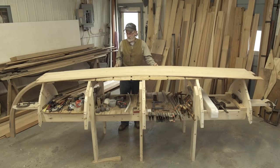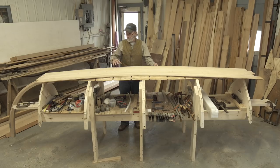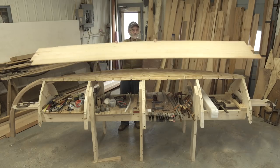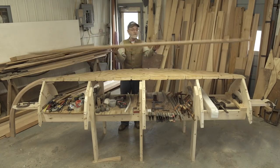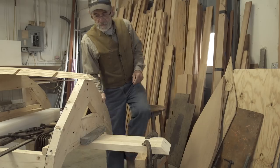The first layer has already been made and set aside, and what we're going to do is set this aside because the next thing we're going to do is put a transom up. The bottom is being made up in layers. I no longer have to handle this like it's four individual pieces — it's one piece. You can hold it up in the air, flip it upside down, you can do anything you want with it, and it's going to be glued onto the boat the same way.